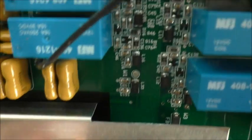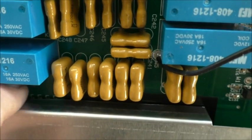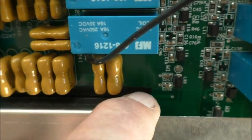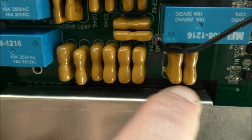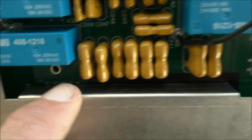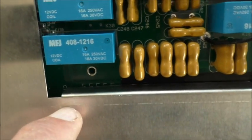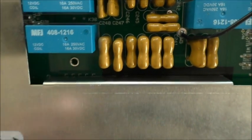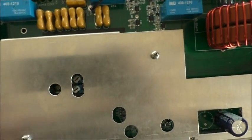So what I've done is I've got some tin snips and trimmed the edge right off this vertical side here, so that it sits about a millimetre above the board — I've also put some tape over the board. It doesn't go down and rest on the tape, so there's no contact. And the same there — I've cut that tab off. There was a rather nasty tab here that went over a couple of bits of print, and one of them was the 12 volt rail. Just having a bit of varnish separating the 12 volt rail from the ground of this screen was not very good at all.